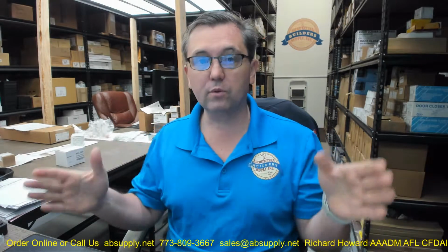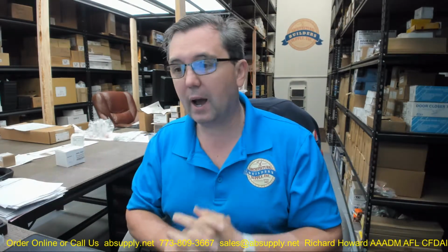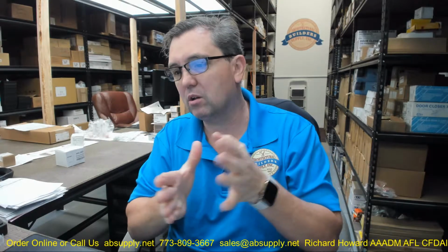The downside of that is you'll have a strike on the floor that may not be ideal if you've got a bathroom. If you have a restaurant and you have the requirement to hold those doors open when the cleaning crew is in there, this would be a great option. You might not want the model with a floor strike. You're going to be cleaning around that. The downside of the wall-mounted models is you need greater clearance to get it all installed, and you may not have that much room when you bring the door to the 90-degree open position, and the floor model might simply be more appropriate for you because you can tuck that all closer together within that space.